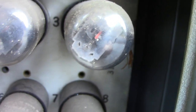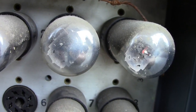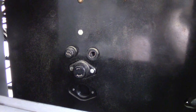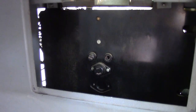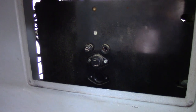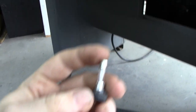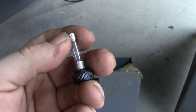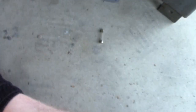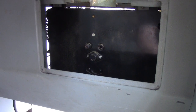Do I want to be ambitious and increase the voltage? The answer with the 100-watt bulb is a distinctive no. It got brighter and then promptly got dimmer again. The keyboard used to reset and then it stopped resetting. I looked here and this is a 2-amp fuse — and that 2-amp fuse is blown. So the 2-amp fuse went open even at around 80 volts. There is definitely something shorted, probably one of those capacitors, so that'll have to be changed and we'll have to do this all over again.